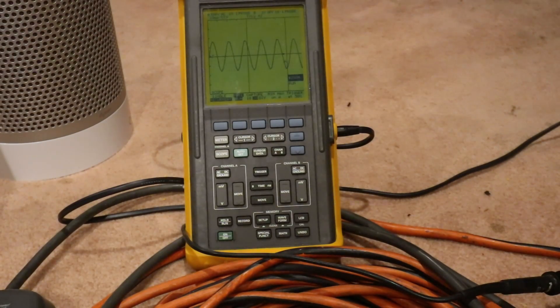This seems like a pretty fair test. We ran it for about 5 to 10 minutes. The inverter was cycling on and off multiple times, which means it was not overheating. It was able to cool itself down, shut off the fans, and then let it warm back up. I am happy with that.